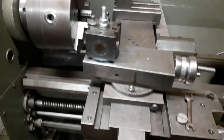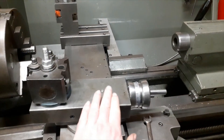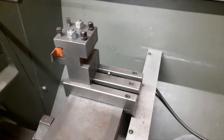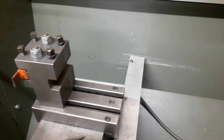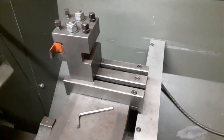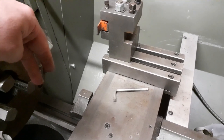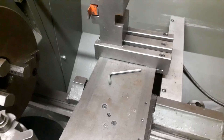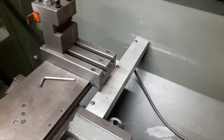So bear with me on this one — we've gone a bit handheld here. First of all, obviously we've got the chuck, cross slide, and top slide as normal. On this particular one we've also got the rear tool post, which has three allen key bolts and can actually slide up and down, so when you're parting off you bring your cross slide in and the rear tool is already ready — less distance to travel when parting off.